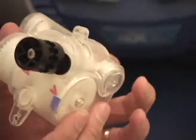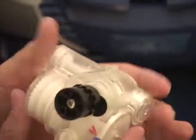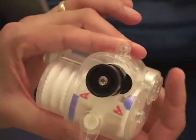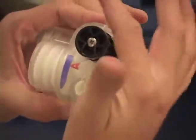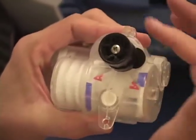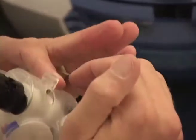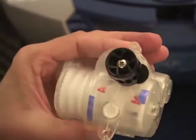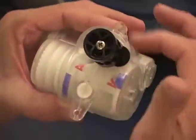The other thing that can happen is we can have a problem if we turn the black pulley in the reverse direction. So I'll move the cams through their normal positions, reversing, then back to forward. If I now turn this pulley in the wrong direction, which is clockwise, you'll see I'm trying to move the cams past the points of the pivot. The problem with this is the geometry between the pivot and the cams is supposed to slide past each other. If those 2 points hook on each other because they're going in reverse, you can cause damage to the unit. So by turning this output pulley in the wrong direction, we can lock up.